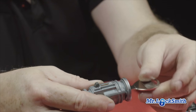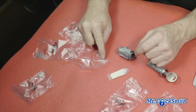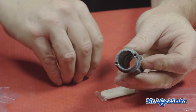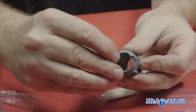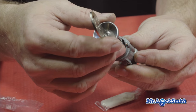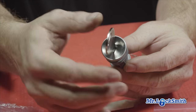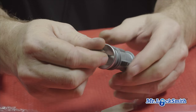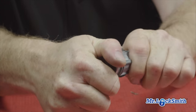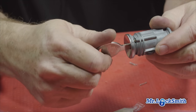Put the key in and your cylinder turns nice and easy. The last part to put the cylinder together is two springs and two pins — one spring, second spring, then your pins go in. Your cylinder will go in, and when you turn it, it locks into position. The cylinder will no longer come out, so the cylinder won't turn unless you put the key in, and the key will turn the cylinder.